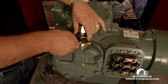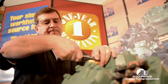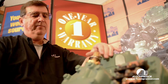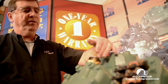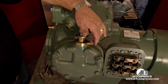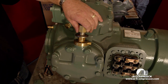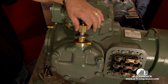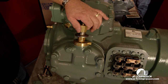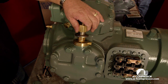Install it back on top of the unloader and tighten it up, then you want to adjust your unloader. Your differential is set right here, so it's really non-settable. Set your unloader to where it cuts out at approximately 60 to 62 pound suction, and it'll come back in at about 72 to 74 pound suction. That is how you install a pressure unloader on an 06E carrier compressor.